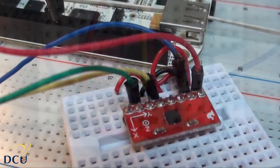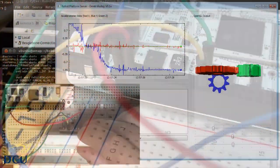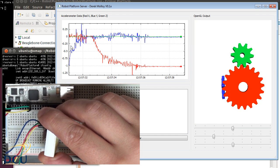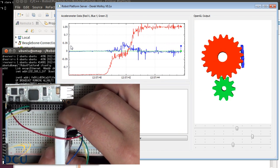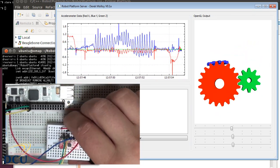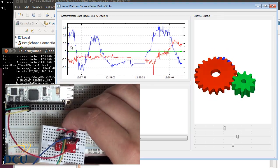In this video I'm going to look at how we can attach a device to the I²C bus and build a program running on embedded Linux to read or write to that device. I've built a Qt application that runs on my PC acting as a server, receiving data from the BeagleBone acting as a client. The BeagleBone reads sensor values from the BMA180 registers, packages them into XML blocks, and sends them using network sockets. In this video I'll concentrate on the I²C part of this application.